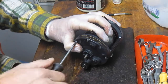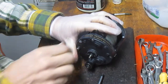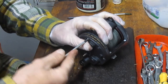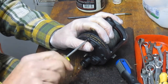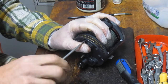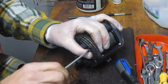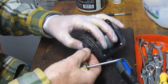Folks ask me why I don't use a mechanical screwdriver. I generally don't — I don't like the torque on them. Taking out the screws, that's fine and you're probably not going to injure anything. If you have a stuck screw you may strip the threads, but going back in on graphite cases I don't like it — there's a lot of torque and you can split the case if you over-tighten. Just a word of caution: my preference is to do it by hand. I understand some folks lack the hand strength, so if using a power tool, just be careful.